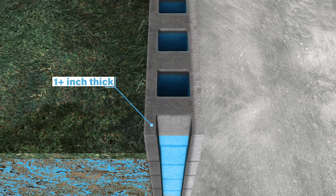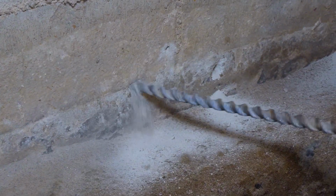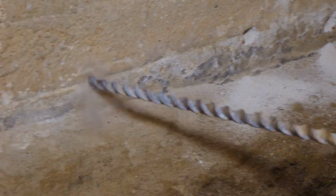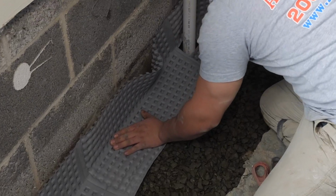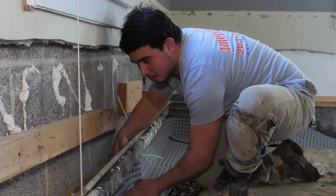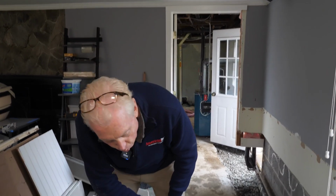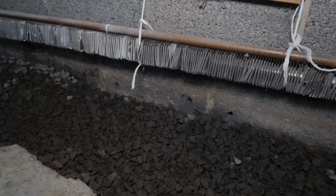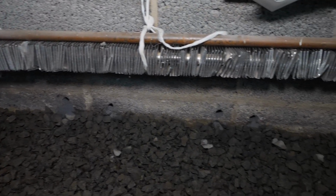And that's a problem. The way we address it is we tap what we call weep holes into the block, into those hollow cores, and we'll even do it where the mortar joints are because that's where another core is also, and allow it to drain. Then we put our drain board up, leave the weep holes open. Any water that ever could absorb in, it'll go through the weep holes and down into our drainage system. And let me show you here where we've put some of our weep holes. If you look, we've drained and we've tapped into each one of the cores of the block and allow that